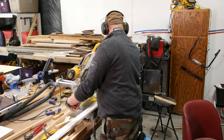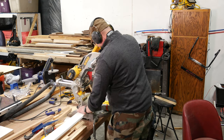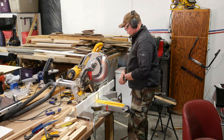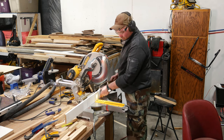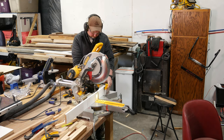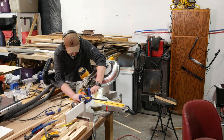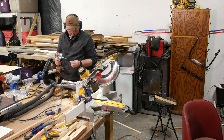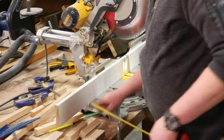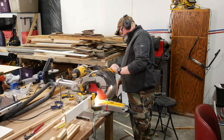To make these cuts on the miter saw, you'll need to attach an auxiliary fence — simply a board screwed onto the saw's fence using the mounting holes on the back. You need this auxiliary fence because the standard fence isn't long enough to attach a stop block for longer pieces. Find a nice flat, straight board about 48 inches long — MDF or melamine works great. Press it flat against the miter saw fence and table, then drive a couple screws from the back through the fence into the board. Cut through the auxiliary fence with the saw, and you're ready to go. This creates a zero-clearance slot you can pull a tape measure from to set your stop block distance.